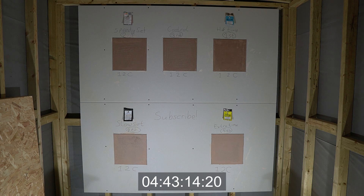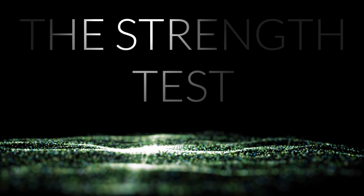It's not all about setting speeds — this is just test one. In test two we're doing the strength test. Most plasterers will know that if you increase setting speed you reduce strength, which is why the guys at Speedy Set have a formula where they're putting fibres in to try to counteract the increased brittleness of the plaster. Let's jump over and enter the strength test.